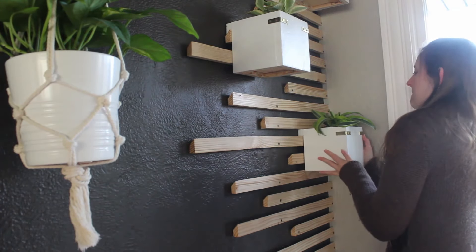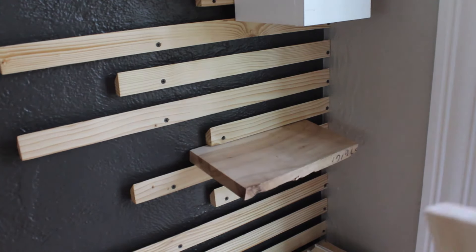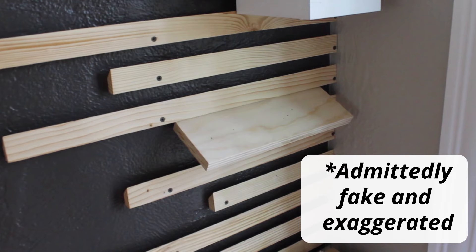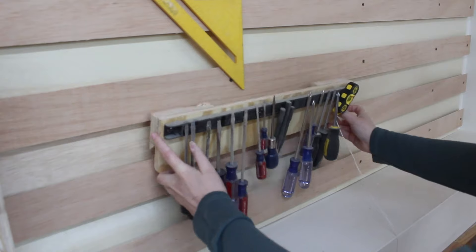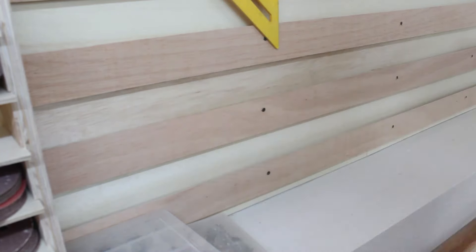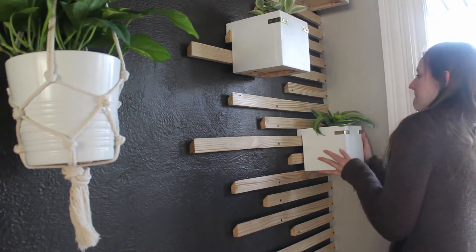Finally, I could actually hang things. Traditionally, slat walls hold things by simply pinching the wood in place between the slats. Frankly, I think this is a terrible idea, because wood changes sizes throughout the year — it might hold your shelf in the summer when the wood has expanded, and then drop it in November when the wood shrinks. Either way, I went with what is called a French cleat system instead. That beveled edge I made locks with another beveled edge against the wall, and you can actually hold really heavy things this way. Usually you leave a lot of space between the slats since you have to be able to lift up the cleat to move it off the wall, but since my slats weren't actually very long, I figured I could just keep the slats close together and slide the cleat off the edge instead.